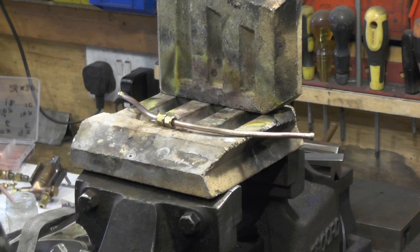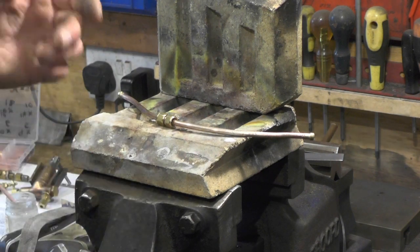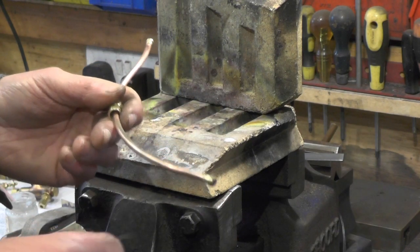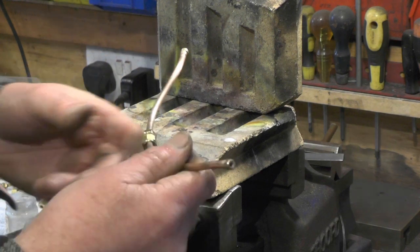I'm ready for silver soldering olives on. I've done plenty of videos with silver soldering, but I'll just refresh your memory for anybody that's not sure. Make sure your copper pipe, or wherever you're soldering, is clean and degreased.